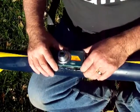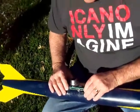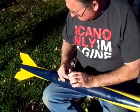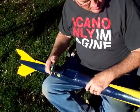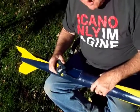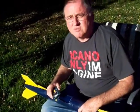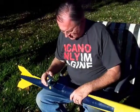The camera only weighs about a quarter of a pound, but that adds enough weight to the rocket that I'm going to go to a motor with a bit more thrust. I plan to fly it now with an H242T, which will generate about 12 G's of thrust initially.